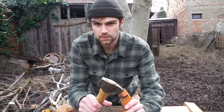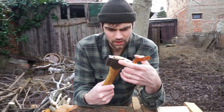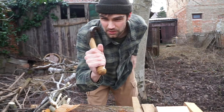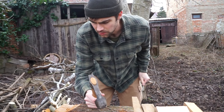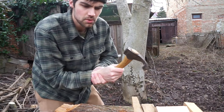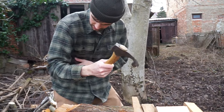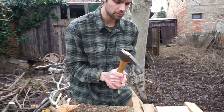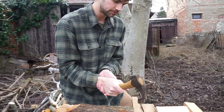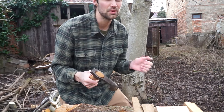The first tool I'm going to use to start hollowing is this one here — this is my adze made by Josh Burrell. It's kind of like an axe with a scoop on the front. The way we want to use this is with our hand placed underneath, wrist for support — it removes any unwanted radius when we're working. I tend to put my elbows into my hips as well just so I can really control a pivot or lack of pivot, being really rigid and removing any variables. I just want the tool to be moving up and down, keeping my elbows locked to my body to remove any unwanted pivot.